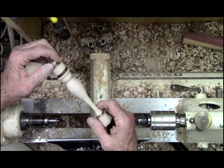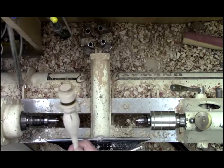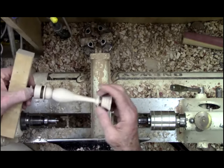All right, great. Well, I learned a little something, and I'm sure everybody else did too. One of the first things that you really should have been paying attention to, if you missed it, especially for new turners, is the way he presented his gouge, using the bearing of the bevel to make those slice cuts. That's very important because gouges are like plows. We really don't want to be plowing our work off. So thank you, Trey. Appreciate it.